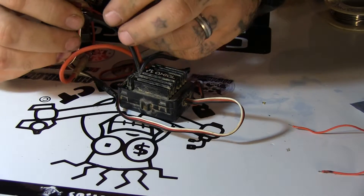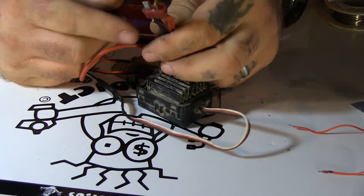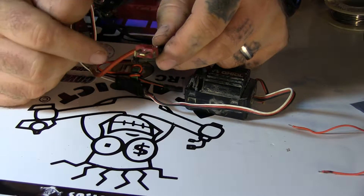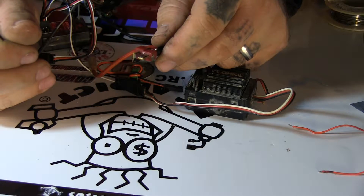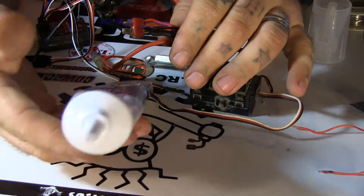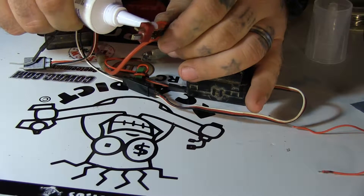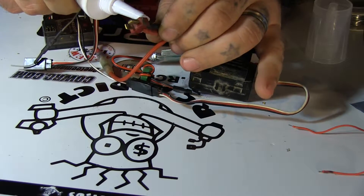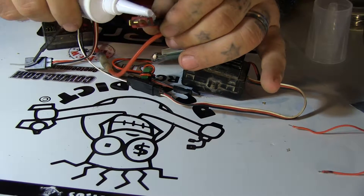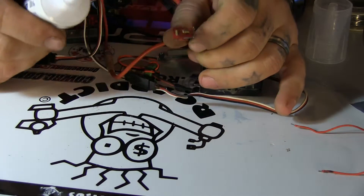Since I've already had this heat-shrunk and I didn't disconnect anything to do this, it's going to be hard for me to reapply heat shrink tubing. I could go a few different ways: apply some liquid electrical tape, wrap some physical tape around it. Today I'm just going to use a little bit of silicone — I buy this out of a squeeze tube, it's cheap. I'll squirt enough around to put a little protective barrier over it. Doing it on the battery end here isn't for the water aspect — it's in case anything metal were to touch it, so you don't short metal to metal.